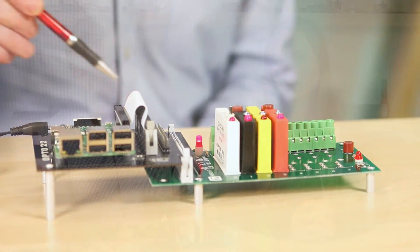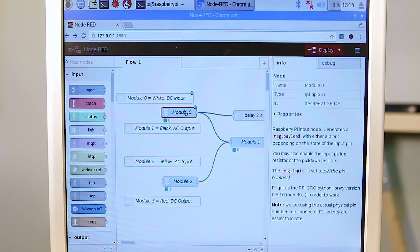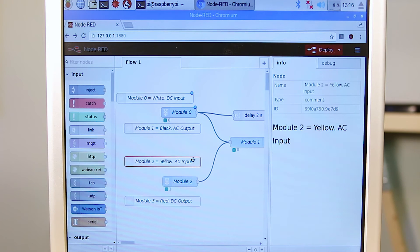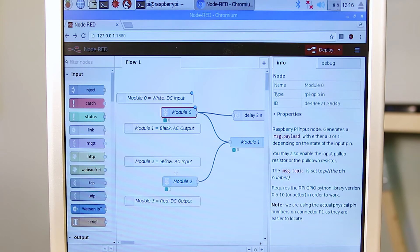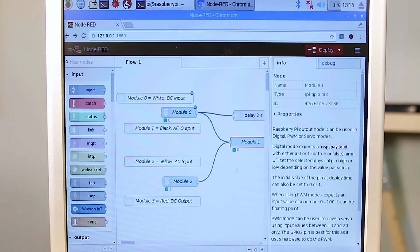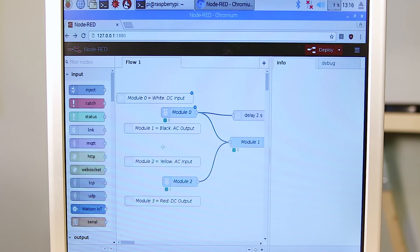We've got a lot of other items on the table here. We've connected a monitor, keyboard, and mouse to the Raspberry Pi running the digital I/O system, so we can demonstrate a free program called Node-RED. This program is used for wiring together hardware devices, APIs, and online services, and it comes in certain versions as a Raspberry Pi operating system. There's a blog post on the Opto 22 website that will guide you through how to build a Node-RED application for querying and controlling the I/O system. You can import a Node-RED flow to interact with the I/O modules on the rack, and if you have a starter kit and follow the instructions, you can turn the modules on and off from the Node-RED software.